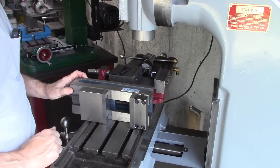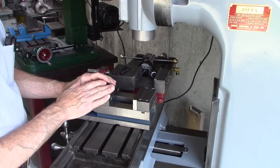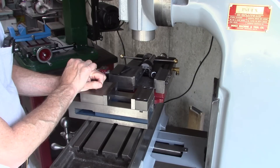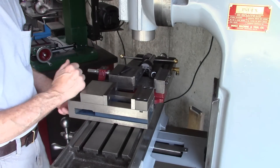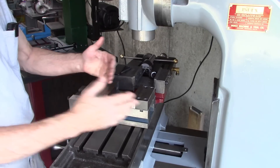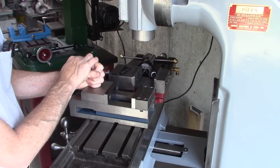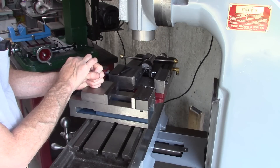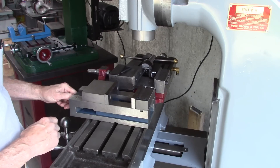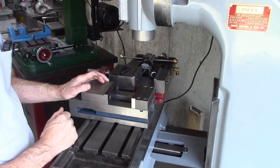I don't know why they designate it as CNC, but it can be clamped to the table on either side — I think you can even mount it to the end. Everything's square on it, but the feature I like best is the fact that I can mount it anywhere on the table; it doesn't have to be lined up with the T-slot. That enables you to utilize the entire travel on your Y-axis. Oddly enough, it was almost half price on Amazon compared to several other websites — I'll put the link below. In order to mount this I've got to make some hold-down clamps, and that's what I'm going to do today.